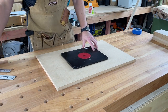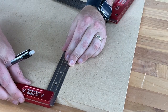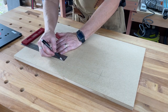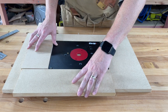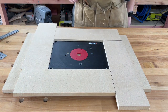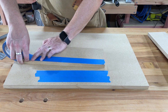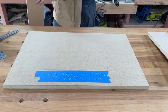Next up we want to cut out the space for the insert plate to go. I want to put it exactly in the center of the table, so I'm going to start by measuring and marking out the top two corners of the plate. With these measurements made, I take four pieces of scrap MDF and set them around the plate to make a sort of fence or guide. To fix each piece of the guide in place I'm going to use the good old blue tape trick — sticking some blue painters tape to both things I want to glue, applying CA glue to one piece and kicker to another, then carefully aligning and sticking both pieces together. Of course if you've got some good quality double-sided tape that'll work too.